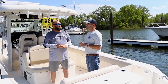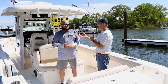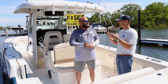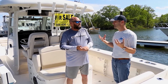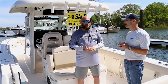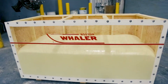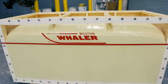So if somebody says — and I'm just going to say what I've heard before — somebody says the problem with that is the foam gets saturated. It can get really heavy with water, and the boat can essentially get waterlogged with nowhere for it to go. True or false? In some circumstances that could happen. It would probably be somebody who ran over something, poked a hole in it, and then didn't give it any attention. Because the foam is a closed-cell foam and that's going to be resistant to water wanting to get into it to begin with.